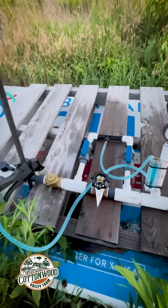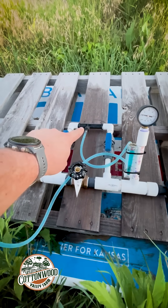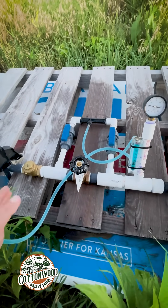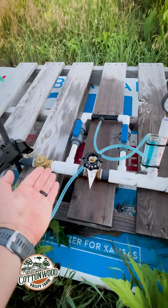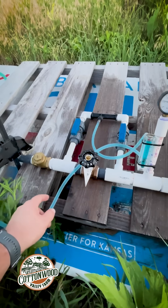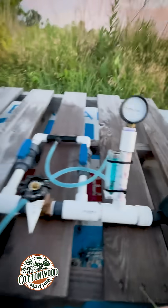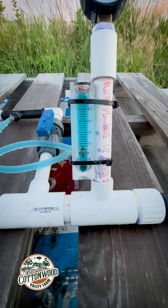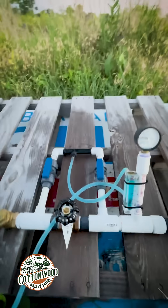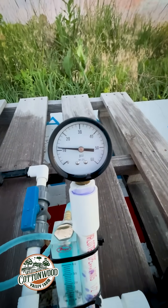I mixed two pounds to about five gallons here, and I'm using a Venturi injector for it. On my injector here — this came from Nolts Midwest — that right there is the Venturi piece. What it's doing is I've got water coming in right here on this side, it's bypassing up in there, and that's creating suction going to the bucket here that's sucking the blue fertilizer up. Right here, you can see I'm pushing about five gallons per hour out of the bucket there at about 11 psi out to the drip tape in the field.